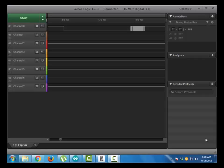Now we will learn about the communication with this sensor. The interesting thing in this module is the protocol that is used to transfer the data. All the sensor readings are sent using a single wire bus, which reduces the cost and extends the distance. On the DHT11, the one wire data bus is pulled up with a resistor to VCC. So if nothing occurs, the voltage on the bus equals VCC.